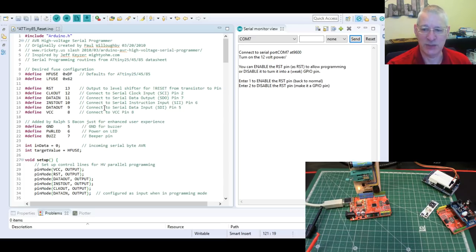For one pin you can probably do a lot of the programming without it, or perhaps borrow one of the other pins just for testing, then reset it all back and say — right, I'm ready now to test properly with P5. Let's set it. The reset pin obviously was set to a GPIO, which is why I could flash that LED. So I want to set it back now to a standard reset pin so I can program it again.